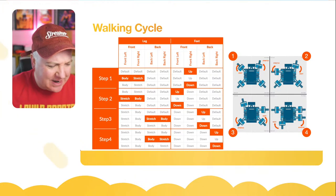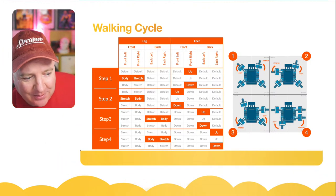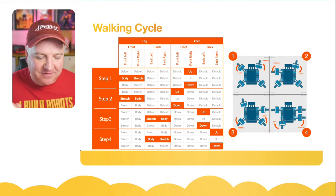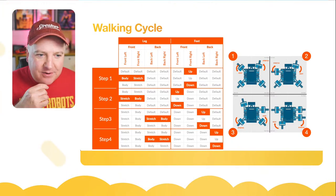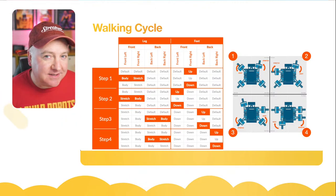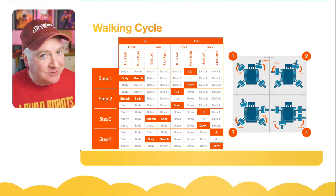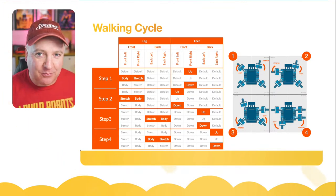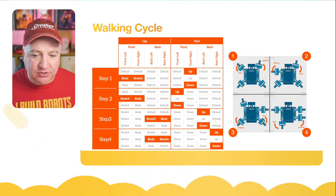If you were interested to know how on earth the robot walks forward, it's quite a convoluted process to get all the different limbs to move. Now, you can get them all to move without any kind of delay, but I created this really convoluted tick system where you would set the angle where you want it to be, and then over the fullness of time it would reach there, and the time would be configurable, so you get a lot smoother motion. So instead of it going one limb and then another limb, all the limbs move at the same time in a sort of fluid motion.